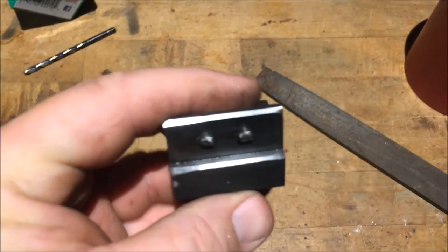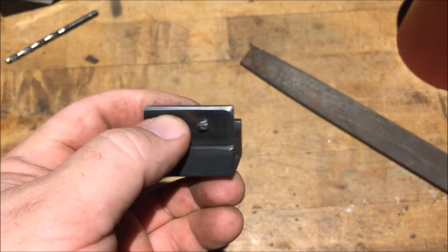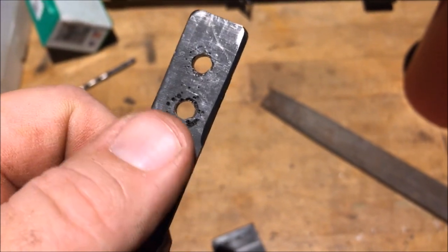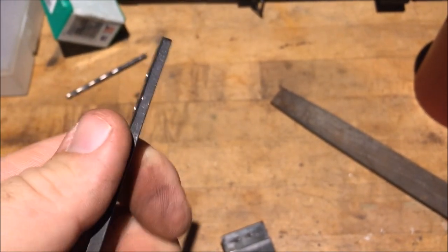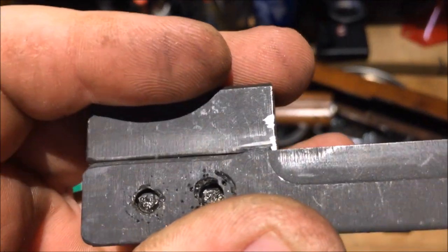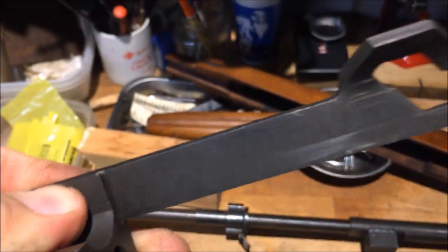So what I've done right quick before I weld it, I prepped it. I put a bevel right there and a bevel right there. These are like spot welds and what it was, this wasn't being pinged on — this was a bad, bad weld job. A lot of impurities in there, that's where those little bubbles all pop out from. So I drilled this out, knocked the burrs off, beveled it on both of the edges that we're gonna weld. I got it beveled right there to put a bead. So let's go weld it up.